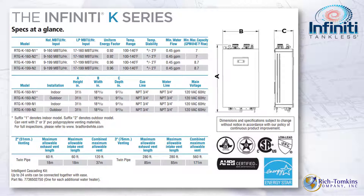When looking at GPM at a 45-degree temperature rise, you're looking at 7 GPM for the 160,000 BTU unit and 8.7 GPM for the 199,000 BTU unit. Notable here: the gas line connection is 3/4 inch across all sizes, and the water line connection is also 3/4 inch.